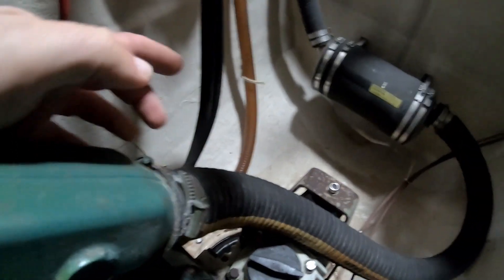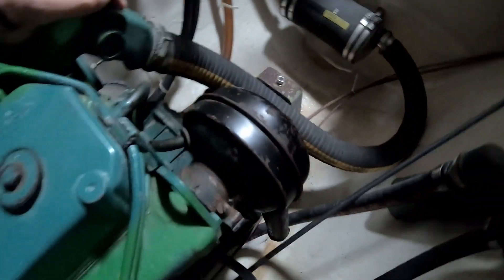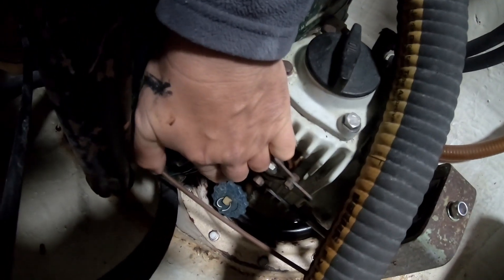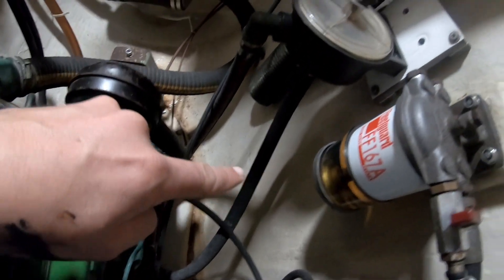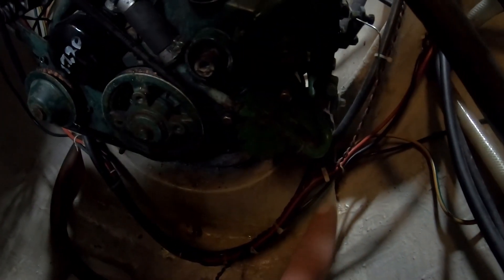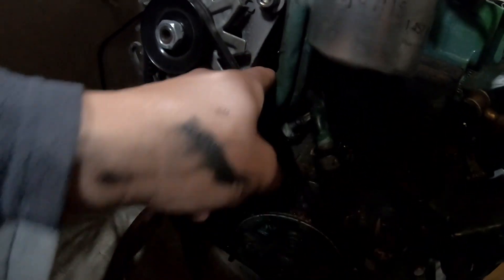To get started I need to take the exhaust hose off — you can see it's straight over the top of the sail drive. I'm also going to take the water inlet out, which we'll upgrade while it's out. Water comes up the sail drive, through a hose with a hose clip, to a freshwater strainer, then back down under the motor and connects to the raw water pump.